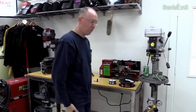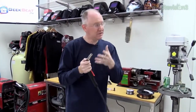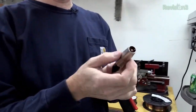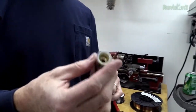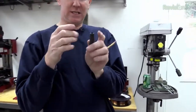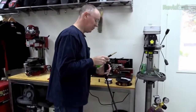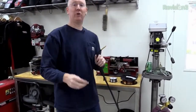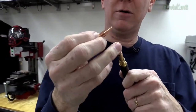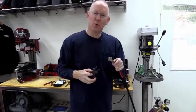As we are doing all of that stuff, one of the things that's going to happen is our torch gun tips are going to wear out. It's normal — it's a consumable item. First of all, we are going to remove this piece called the nozzle. When you are using flux core, you don't use this particular nozzle — you use this smaller one, because it doesn't need shielding gas to come out. The other thing that's even more critical is this little contact tip. It has a tiny hole in it and it's what the wire feeds through, conducting the electricity into the wire to make it all work. These tips wear out — it takes a while, but they do wear out.